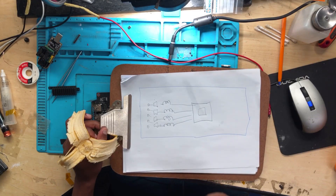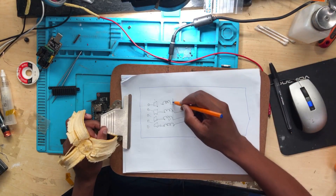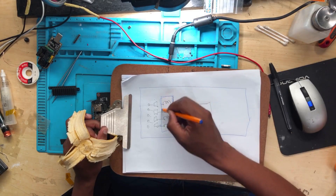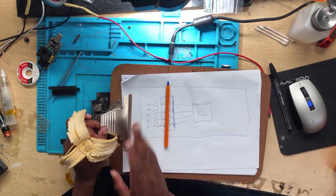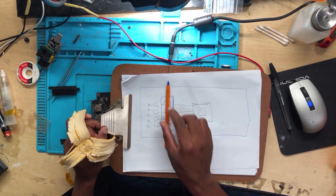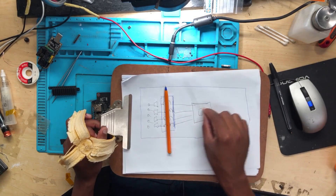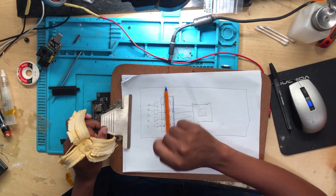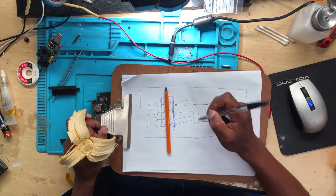What we do is separate the two sections. Take a blue pen and mark the gap between them. By removing the coils — which are the components connecting the two sides — we isolate them. When I checked with my meter, the short was coming right from the GPU side.